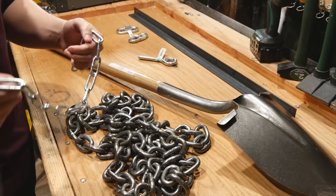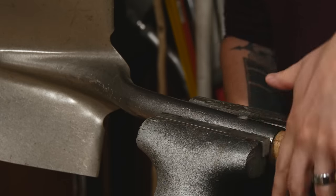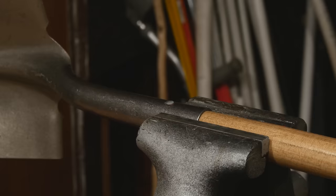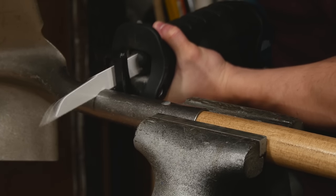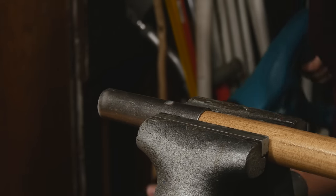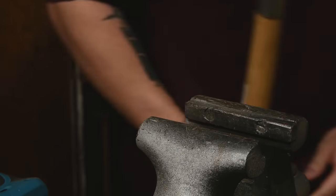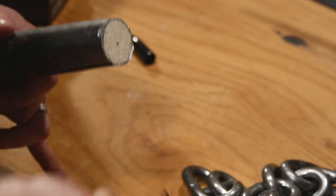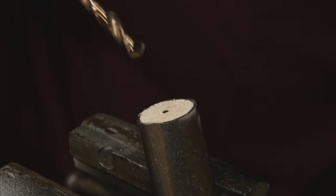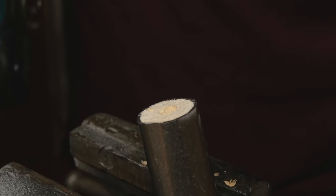I'm going to do my best to clamp this shovel with my busted vice - next Teespring payout I'm getting a new vice. The Sawzall is no joke. Mark the middle and drill it out with a bit that is the minor diameter of this lag bolt - someone taught me that in the last video - which means the drill bit is the diameter the bolt would be if there were no threads on it.